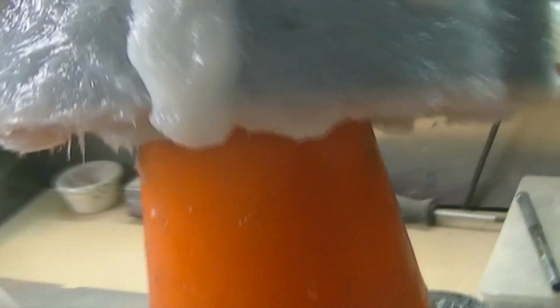I'm going to do a split mold just to give it a bit more ease out of the mold, because I'm also molding it under here, as you can see. I'm going to do a 3-part mother mold, one for this side, one for that side, and one like a ring on the bottom. So we'll see how it turns out, but I'm going to split it here, and that's why I've added these 2 mold keys on each side, because when I do the ring, that will go all the way around the helmet to help support the bottom here.